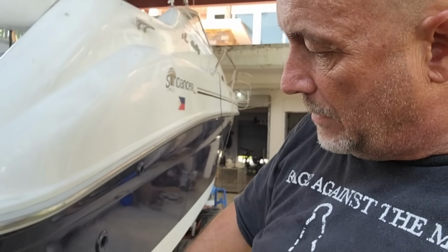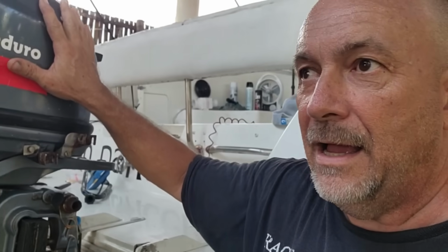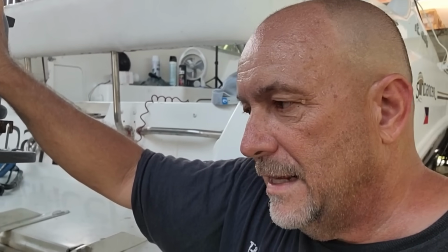There's other things that I have stripped from the boat too and took weight away. I've actually been minusing the weight on this boat, not adding. Now, when they design it, they design the boat for a certain amount of weight of how deep it's going to sit and draw draft, right? And if you get it up too high, it'll get unstable and rocky. What I mean by too high is if you put a really light motor in it and it doesn't have any of that weight that it was designed for, now the boat's going to sit higher in the water, and on this shaped hull, it's going to bring it up out of its stability, and it's going to get this teetering. So you do want a little weight back in there. Thus, I have the room to play with to have this outboard on here.